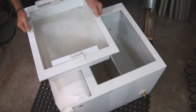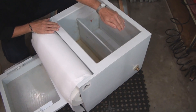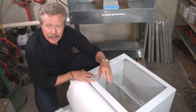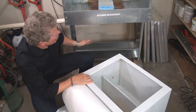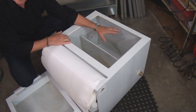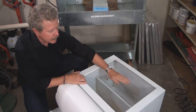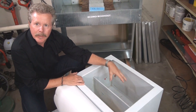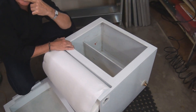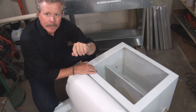This will depend on your installation. Some things have to be done periodically. If you have a floor drain, you take that attachment and connect it directly to your floor drain, and the water just goes out. However, in Jonathan's case he has a wall drain coming straight out of the washout booth to the side, so this unit won't drain that way. At that point we add a discharge pump — an electric discharge pump that sits in place. At a certain point there's a float on it; when the float gets up to the high side, it'll automatically kick on, discharging all the water out right into the drain. Basically, if your drain is higher than the outlet on this unit, you use the pump to move the water into the drain.